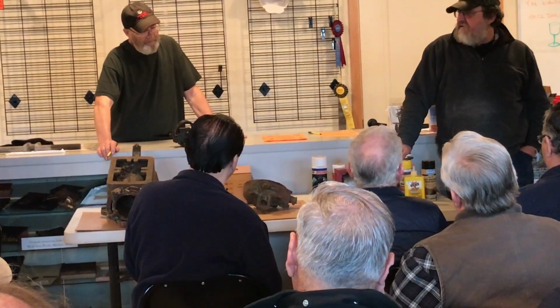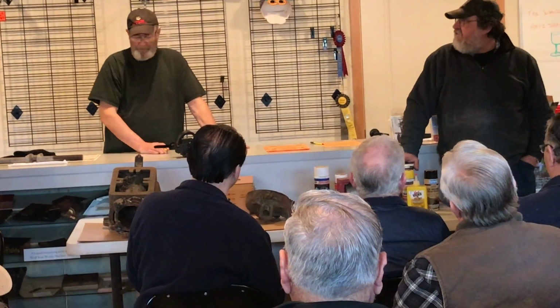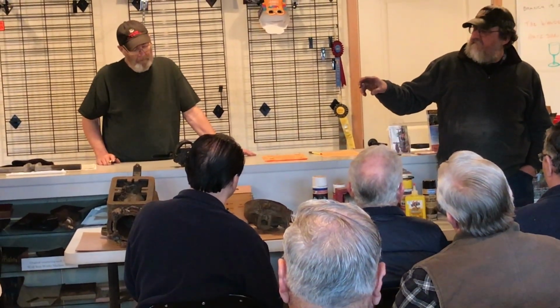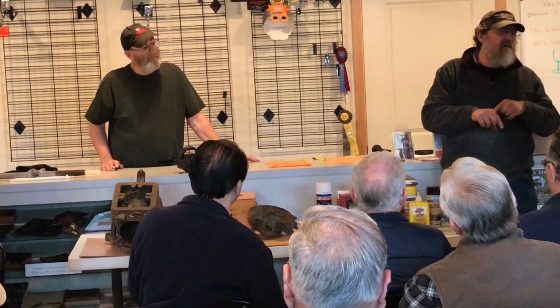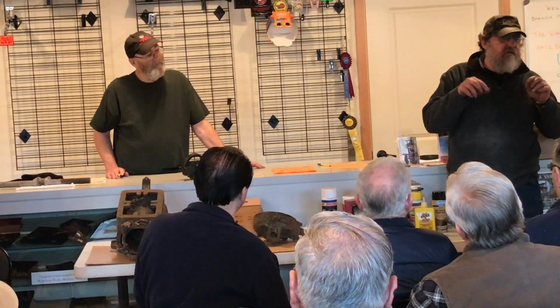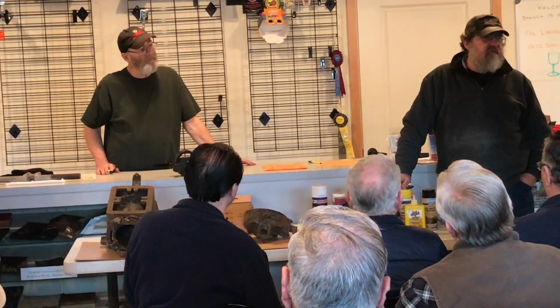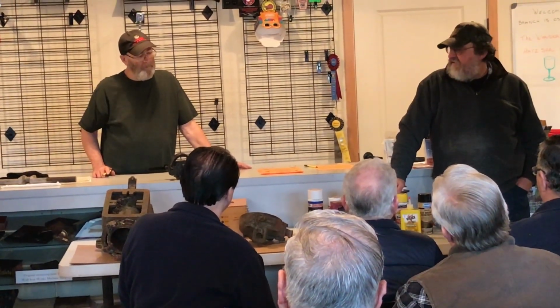I've used electrolysis to unstick rings, pistons, or the inside of a hopper that was all rusty. I set it up reverse and put the electrodes inside the hopper to break down all the rust inside the hopper. There's a bunch of techniques.